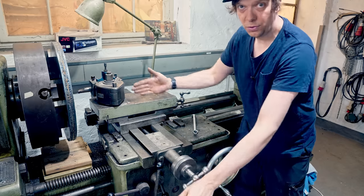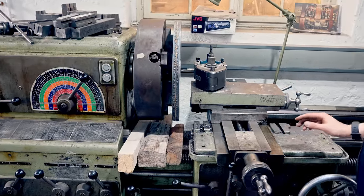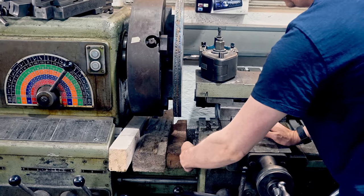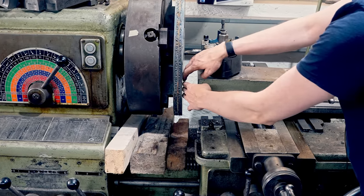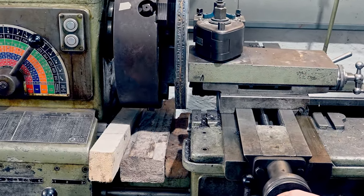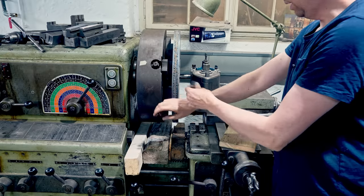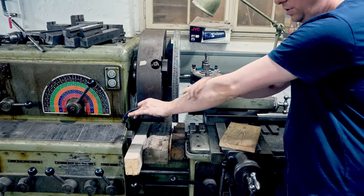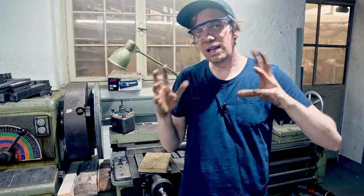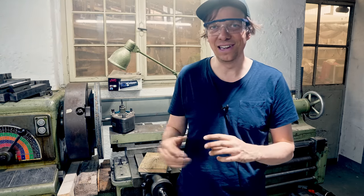In this direction I'm going to use this wheel to go in and out, and to set the cut depth I'm using this wheel. Counterclockwise the whole disc moves towards me, which means a deeper cut. We have not found a positive stop on the machine, so what Jeremias did was just place some wood right here, which means this side crashes into the wood before the machine crashes into the wheel. No gloves, no loose arms for safety. Safety glasses but no ear protection because you want to hear how the machine sounds — and the lathe turning is not too loud anyway.